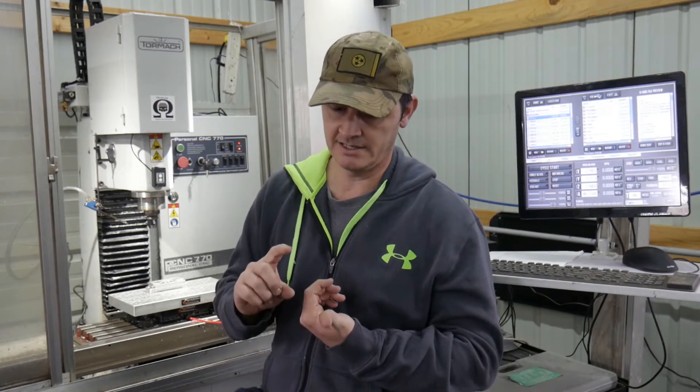For the enclosure — let's call it version 2.2 — I noticed real quick that I wanted something to catch chips and keep them from flinging everywhere, especially when running a shear hog or doing an adaptive toolpath. Chips go right out of the pan and end up in a 10-foot diameter from the mill. Since I'm using a fog buster and not flood coolant, I started with plywood coated with Flex Seal to seal it from moisture. That worked well.